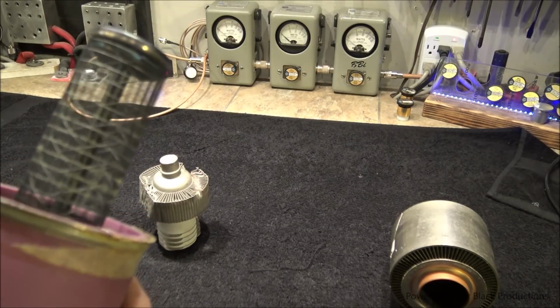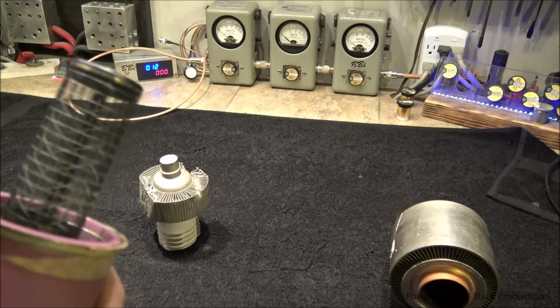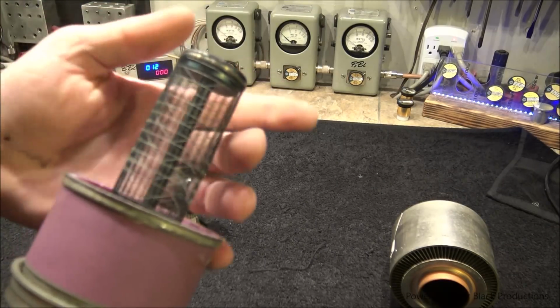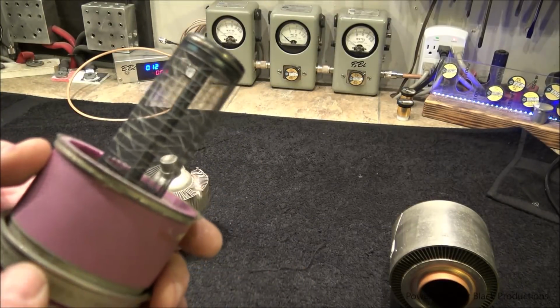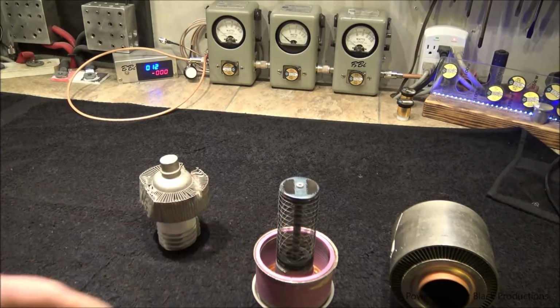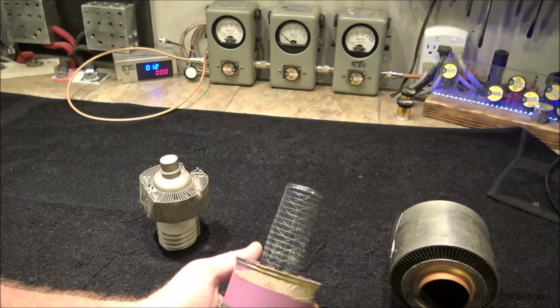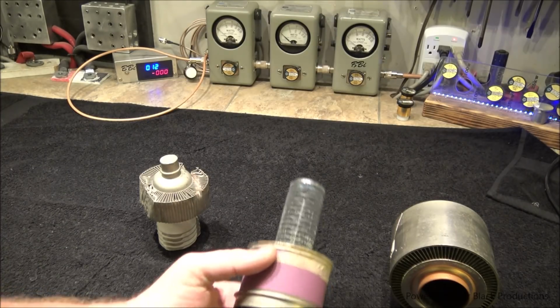Now, the reason this tube went bad, well, the CB owned it, and they were squeezing the watts out of this thing as hard as they could. And what happens is this spacing of this outer screen to the inner screen is incredibly important. Now, in a laboratory situation, or if you're going to use this in a transmitter, you're going to have exacting voltages and amperages that you're going to apply to the tube. In the radio world, from the hobbyist's point of view, and I use this term very lightly here, the actual applied voltages wildly differ from the data sheet. There's guys that'll put 12,000 volts on this little guy, and through the use of bias and lots of error, they're able to control the tube.